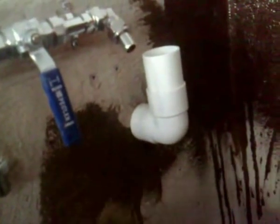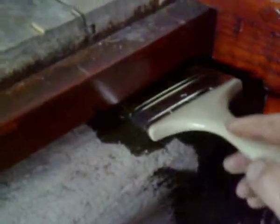Make sure while you are applying the G4 that you haven't missed any areas, especially in corners and around fittings and fixtures. The fibreglass laminate is prone to delaminate away from PVC fittings, so it's a good idea to coat these with a bonding primer such as Micro Seal T20, also available on our website.